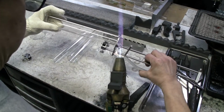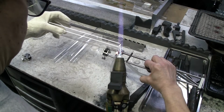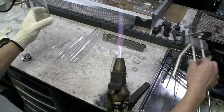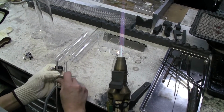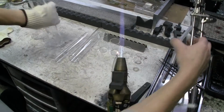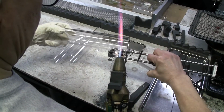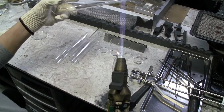If the fracture line does not expand into a crack, do not apply water to quench the crack. Let the glass cool down to room temperature. Check to make sure you have a thin, shiny fracture line around the interior. Set your fire a bit hotter or a bit wider and reheat the fracture line. If a crack still does not form, it is likely because of residual strain in the tubing from prior work which was not annealed. This tool works best on well-annealed glass of consistent thickness.